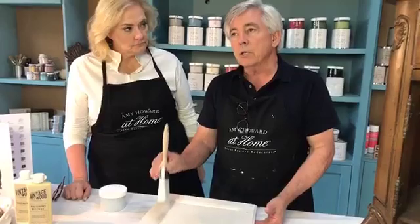The synthetic brushes will give you a smoother finish and help reduce brush marks in the paint. We also recommend that when you're painting your cabinets, if you're using a brush, use a brush for everything. If you use a roller, use a roller for everything. There's a difference in texture — if you brush the door and drawers and come back and roll the facings of the cabinet, you're going to see a difference in the texture. We want it to all be uniform.